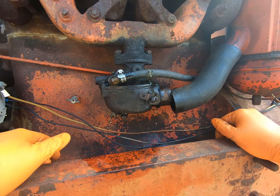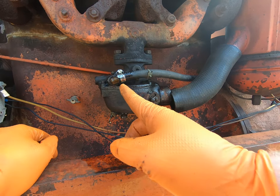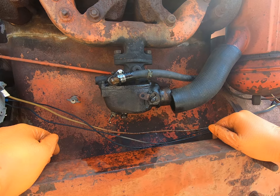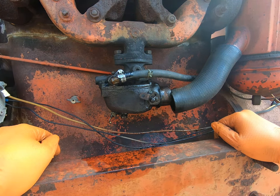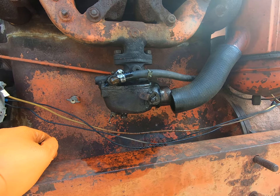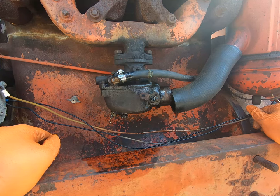What I thought was going to be a simple fix - my non-start problem today is actually a symptom of something more complicated. The gas is not only leaking from here, it is now leaking out of the intake of the carburetor. That tells me either the float has a hole in it and it ran well yesterday because the bowl had been empty, or the float isn't set properly. My guess is the float has a hole in it. I probably need to rebuild the carburetor or at least take the bowl off. I'd prefer to get it in the shop first - out of the elements - so I think I just need to go ahead and push, pull, or drag it into the back of the shop.